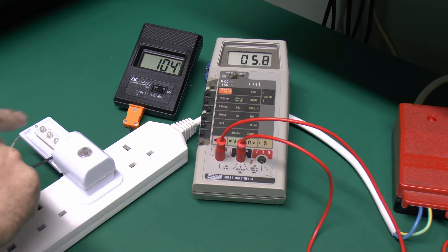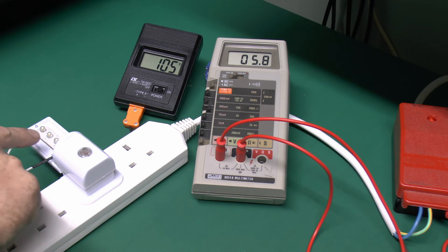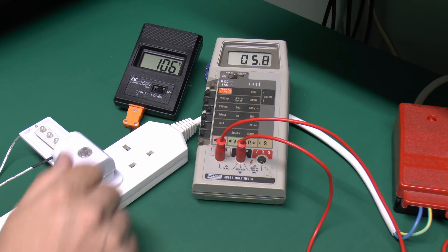This has been on for about 4 minutes now, and the temperature seems to have stabilised at around 102 or 103 degrees Celsius. Now by any standards that is pretty hot, and if I put my hand here I can actually feel the heat rising off of those two resistors, which certainly isn't good. Bearing in mind that the cover is not actually on here, so in terms of cooling this is actually better than it would be if the cover was fitted. Normally this would be in more of a vertical position anyway, so the heat will be rising up from those and basically going across those three LEDs, causing those to get hot as well. And it's still actually rising very slowly — about up to 105, and still going up to 106. Current-wise it seems to be about stable at 5.9, or 5.8 or so.